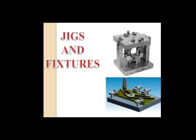In hydraulic clamping, as oil is incompressible, it can be used to exert larger clamping pressure. Oil is recirculated in this system through reservoirs. The speed of the hydraulic device is generally slow as compared to pneumatic devices. Apart from this, it eliminates other limitations of pneumatic systems.